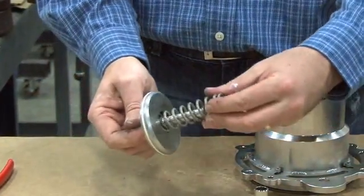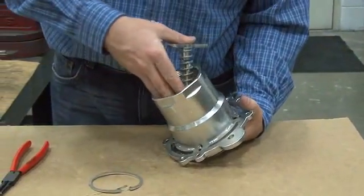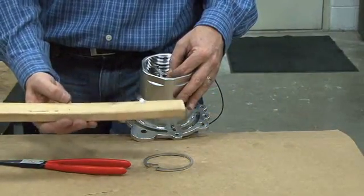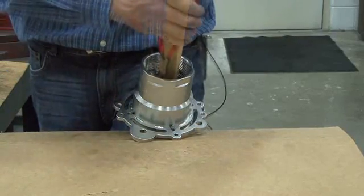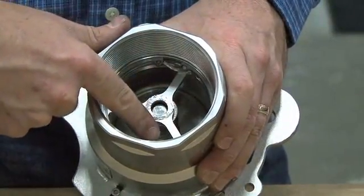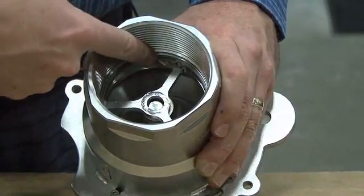Reassemble the first half of the coupler by putting the spring over the poppet and inserting the spring guide into the spring. This poppet assembly can then be guided back into the body of the unit. With larger units, such as this 4-inch model, it is advisable to put the base in a vise or on a surface that allows you to push the poppet assembly down as you replace the locking ring — you can use the butt of a hammer or a piece of wood as shown here. Once the poppet has been pushed down, the locking ring can be guided back into the groove using your snap ring pliers. The locking ring is completely engaged in the groove inside the body, and the safety tab is back in position, keeping the ring in place.